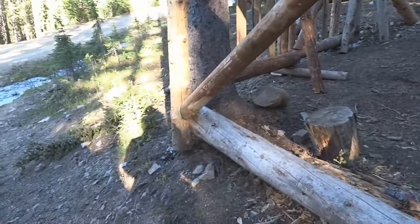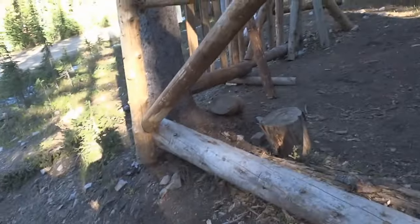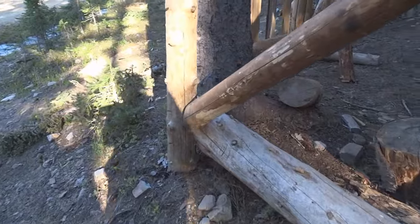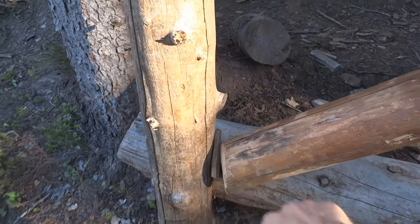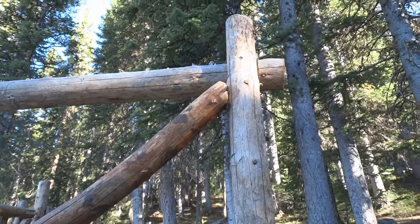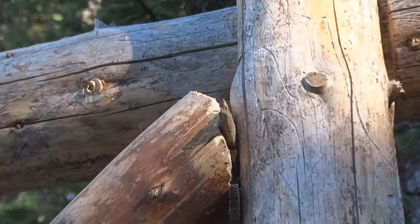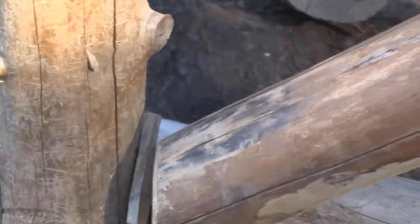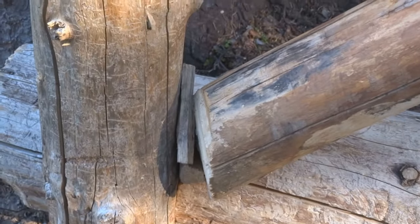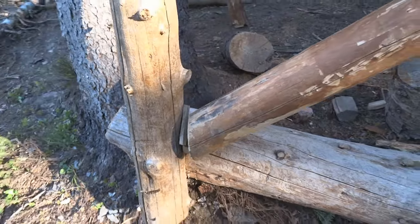It was easier this time because I had a cordless drill — made a few pilot holes and got them in. Then to finish it partially I've wedged it, which basically makes up for the distance. What I'll probably do at the top and bottom ends is get some wood filler in there, trim off these wedges and wood filler it out, so it disguises any ugly gaps. It's going to be a real nightmare to wood filler over here, but I'll do it little by little.